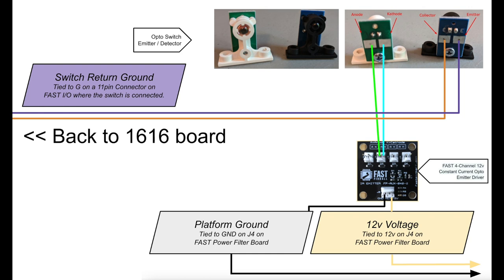The other one I had in my hand is a different one that Pinball Life sells — it's supposed to be able to be either an emitter or a receiver. I actually have a bunch of them left over from my Stern Star Trek SAM system, and they work great in there. But they do not work with the FAST hardware controller set. I tried exhaustively, got help from a bunch of other people, and they just — due to slightly different power modulation or something — do not work with the FAST hardware controller with this little board. So do not get those; instead get the pair. It's actually a little bit cheaper.